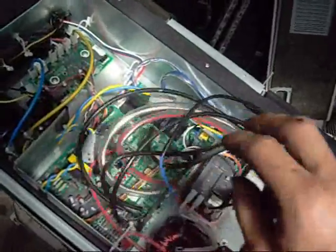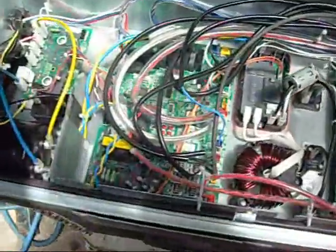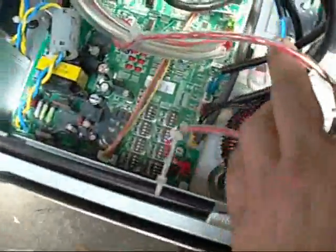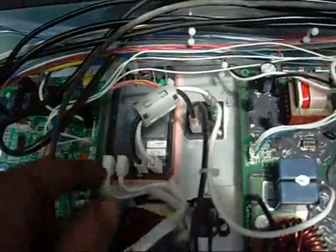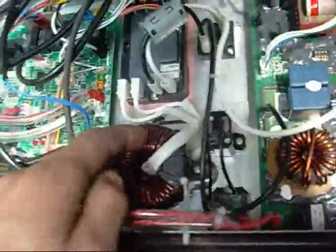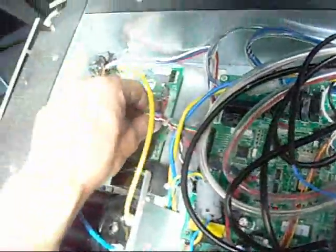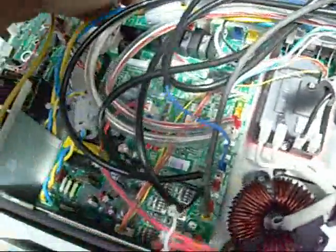Fujitsu don't supply second-hand parts or new parts for out-of-date units like this one, so you're stuck either way. Alright, before I get too carried away I might wire this thing up and see what it does. There are tons of dip switches here — hopefully there's a force run button somewhere. It's got a nice big bridge rectifier feeding into this control module, a choke coil — DC choke or whatever that is. Funny how it's set up: that's an IPM drive module and that's an ACTPM brick, all part of a similar family to an IGBT — insulated gate bipolar transistor.